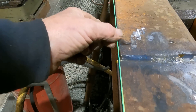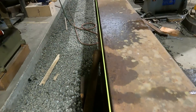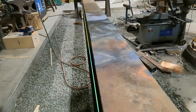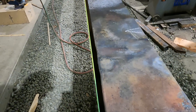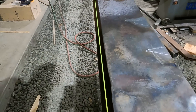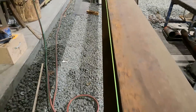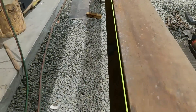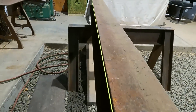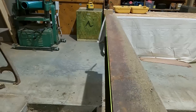At the splice, we're zero on the edge of the bent beam. Here's the worst of it — but I'm not going to try to fix that. I've got five sixteenths in the open, and it comes down and maintains three sixteenths. Now we're down to an eighth. Still an eighth. And then the last four feet is touching.